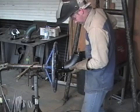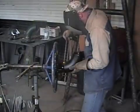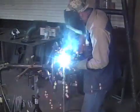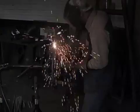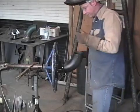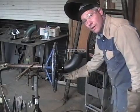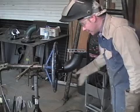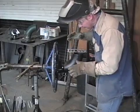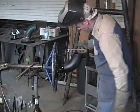Level. Got it. Now I can take my spacer out. Now I can level this way before I secure this on the bottom with my tack, because once I do that, this thing will not be able to move this way. But if I did not put my tack somewhere and aligned it this way, I wouldn't be able to roll this side to side with these two tacks in it. That's why I fit it up that way.